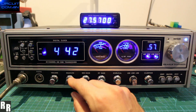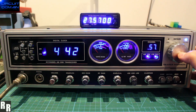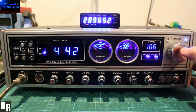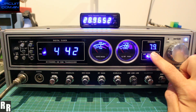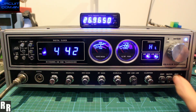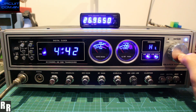Now we're going to make sure the squelch is definitely on. Five button press — 1, 2, 3, 4, 5. And we're going to choose PLL, so obviously MC145106. Encode. In this radio, no matter what PLL is inserted, it's always going to be 79, because it's the mathematics of the antenna frequency and IF filter stages. Squelch — yes, definitely high.